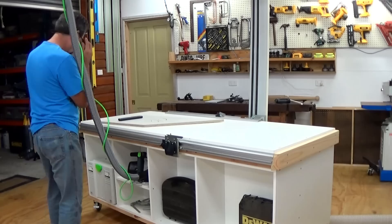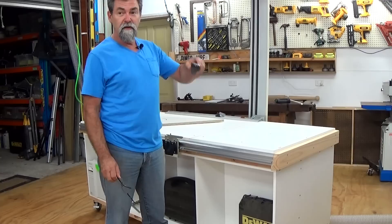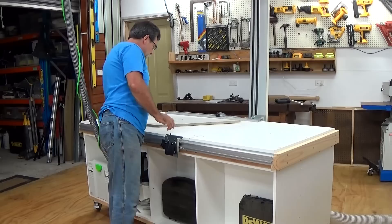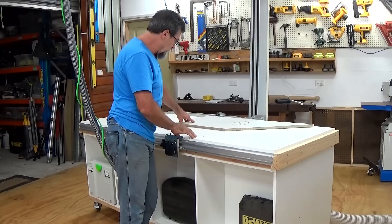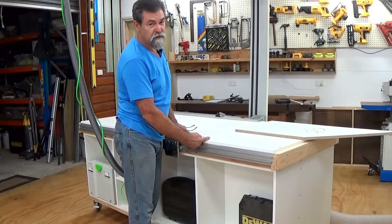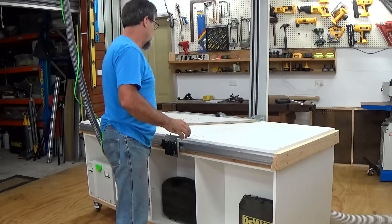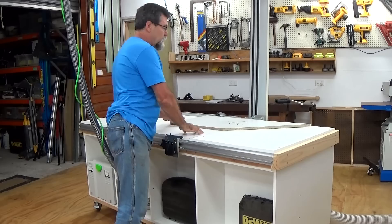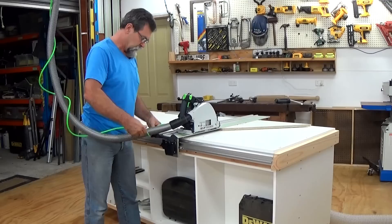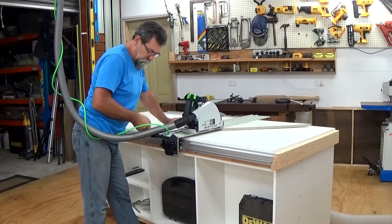Now I'm going to cut a piece of wood. I've got this trusty start for my dust extractor down the back there. Here's a piece of melamine that's around about 450 wide. Remember, it can go up to 800 millimeters wide - not a problem at all, 12 feet long. If I was to have that much of an off-cut on an MFT3, it would have fallen on the ground. You only have around about five or six inches off the edge of an MFT3 before it's starting to drop. Big design feature. I'll slide that along just to show you that it does work. This guy is hooked up to the shop vac. Drop that down, put that on there, make sure the lead's on this little protector which stops it catching on the end of the aluminium there. And let's give it a shot.